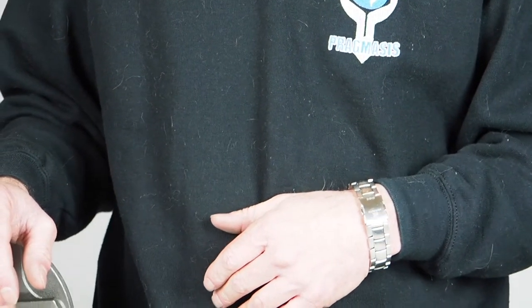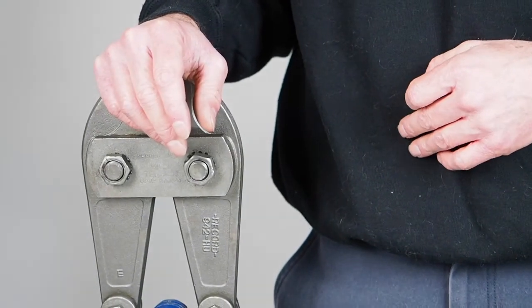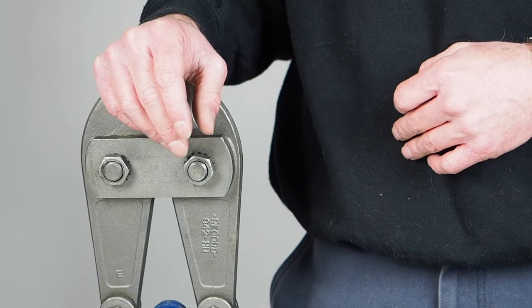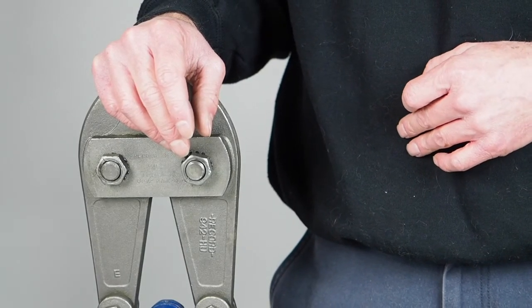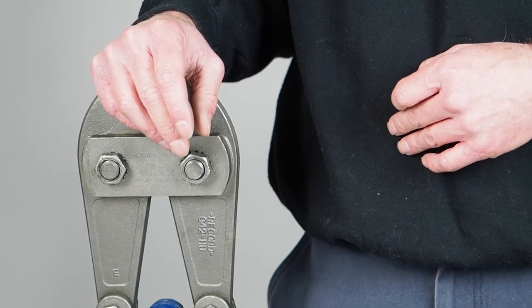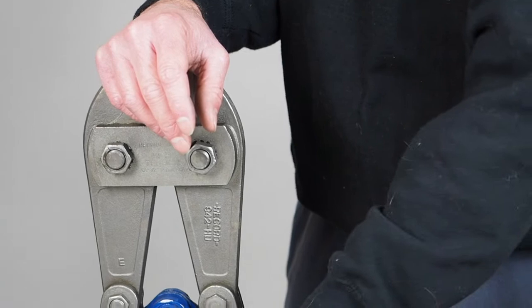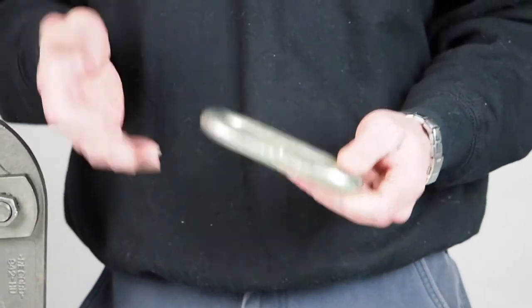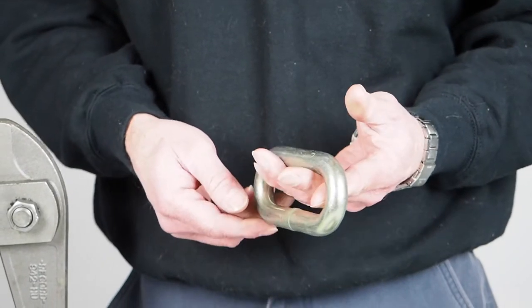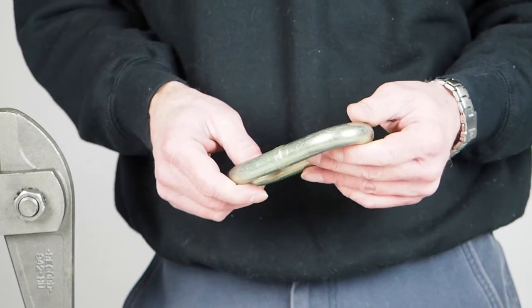So we actually use materials that allow us to get a subtle and controllable amount of ductility combined with strength from the core of the chain. We don't want it fully hard through the core, but we also don't want it fully soft. So it's a careful balance. Getting that balance right is not so easy, which is why we use a specialist company and we do a lab test on every single batch so we can check what we're producing.